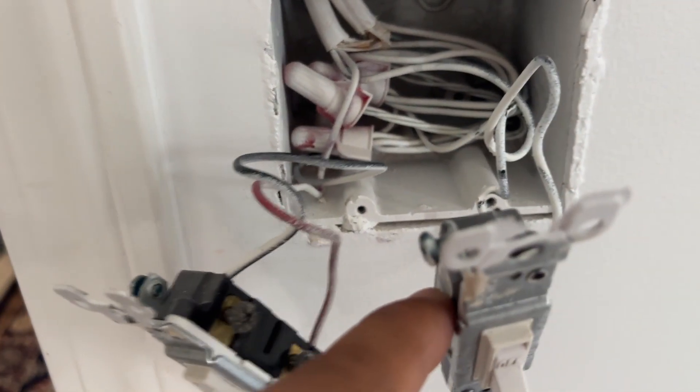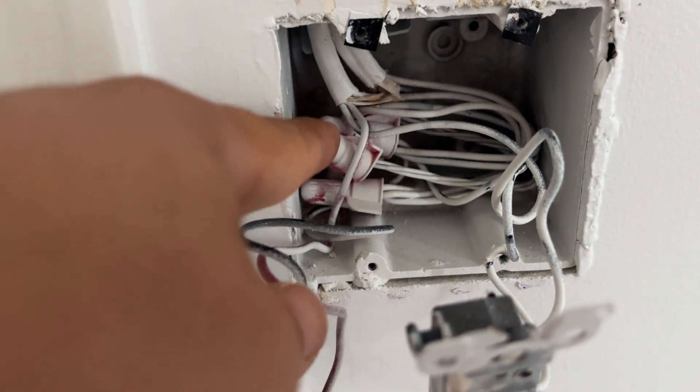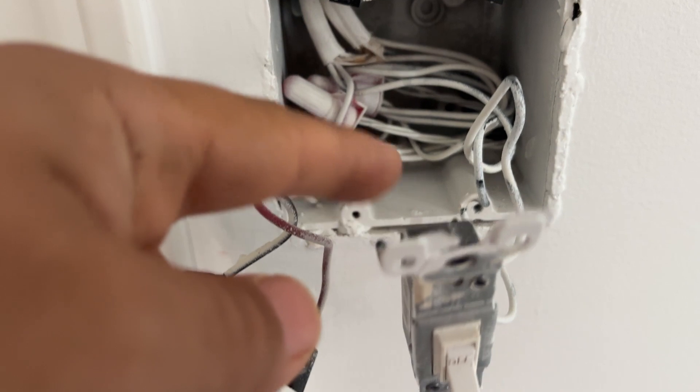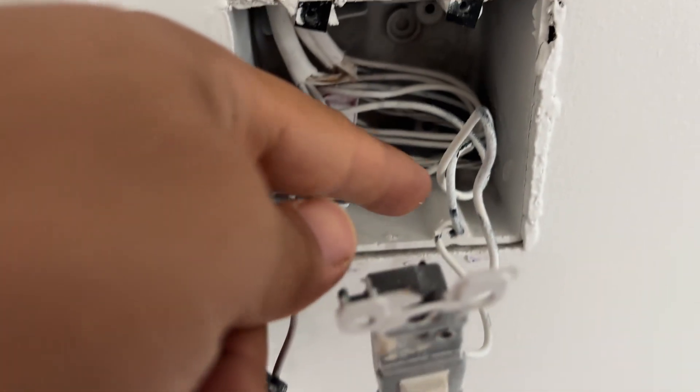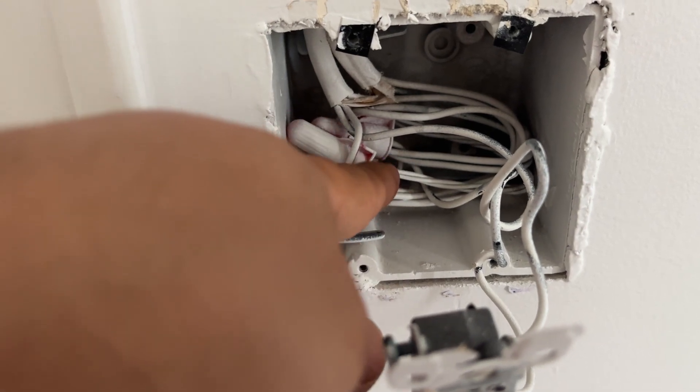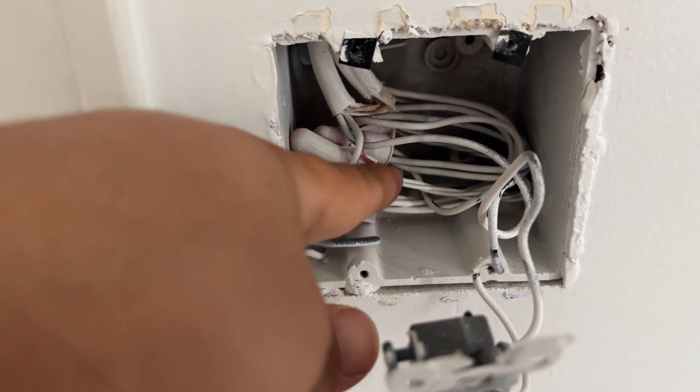You can see here. And on the right switch, you'll grab the black wire from that four-wire conduit. You'll connect it. And then the black wire will be from the other conduit. And you will combine all those black wires together.